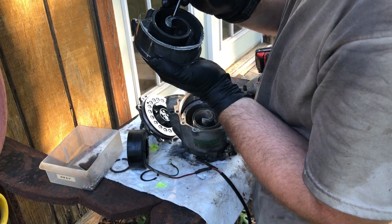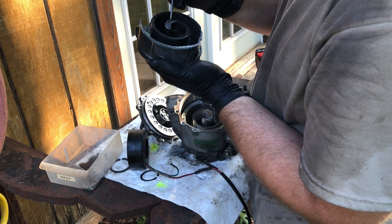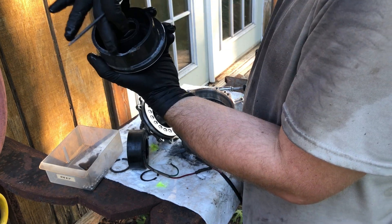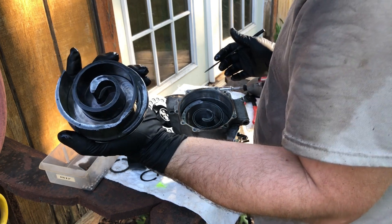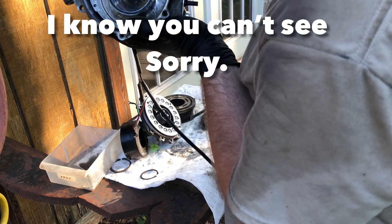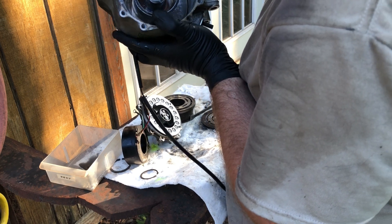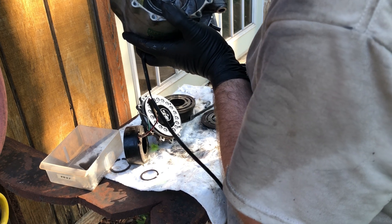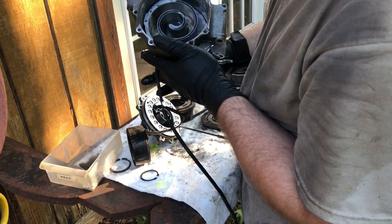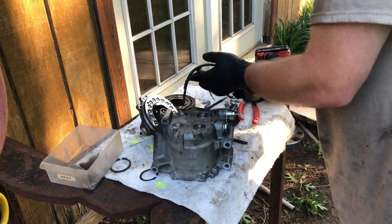I don't know if this is supposed to be a seal — phenolic — yeah, it looks like there's supposed to be a phenolic seal in here. And check that out — there we go, there's our problem. That damage isn't from me taking it apart. There's more damage right here on this ledge. This groove ring — I'm not sure if that's supposed to be full of material. You can see it got kind of hot in there, there's discoloration. I'm using an oil absorbent mat — not worried about making a mess, it's not that big a deal.